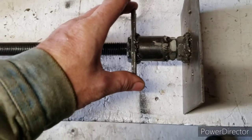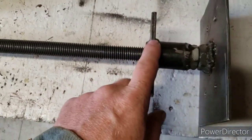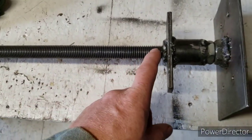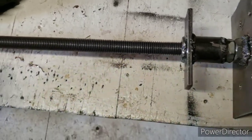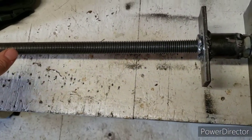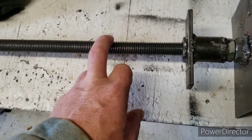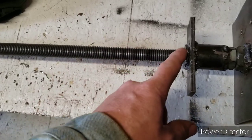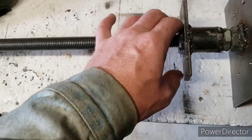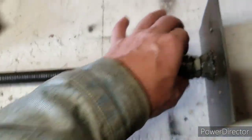Come down to the other end and welded a little bit on the inside, but I did that for one of them and I'm thinking it was overkill because the gravity - the weight of the scaffolding is going to be resting on here, so it's down. The nut can't go past the flat bar or the pipe, so it's all there. As long as it's welded together and not moving, it's not going to go anywhere. Even if there was no weld on the top, the rod is two feet into the scaffolding.